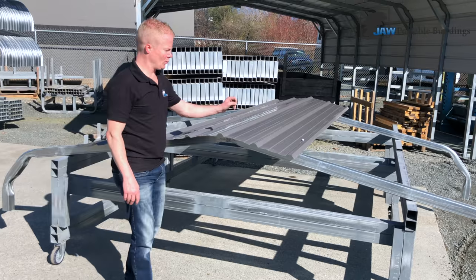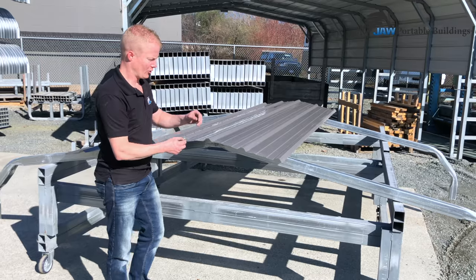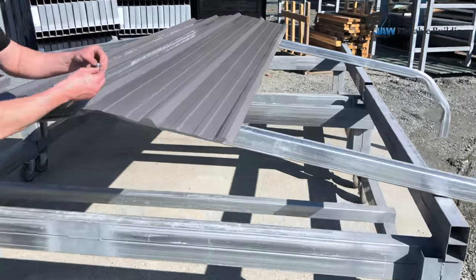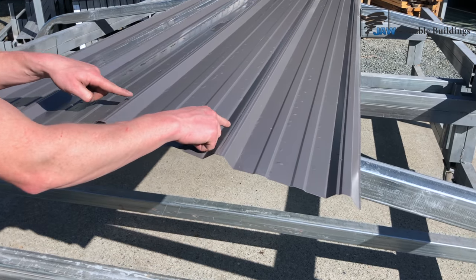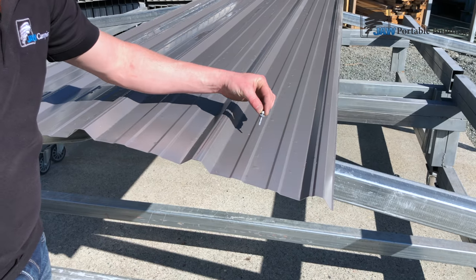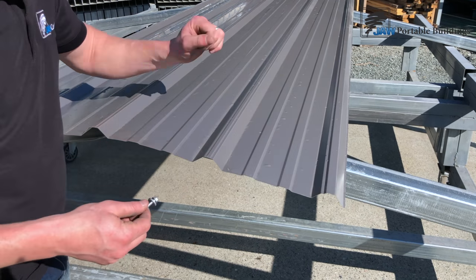As far as screwing goes, you've been given all the same screws — the same screws do the frame as they do the roof. For your screwing pattern: this is what we call the mountains and this is what we call the valley. You're going to put one screw on a mountain here, another screw on a mountain here. You don't have to screw every mountain — put one screw in the valley, and wherever you put it is sufficient.